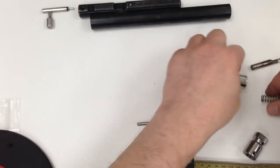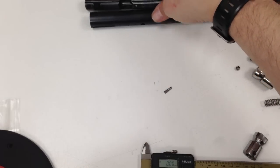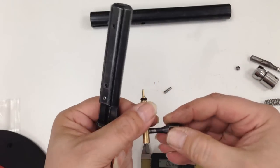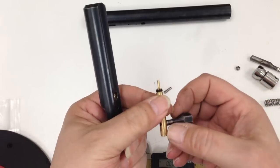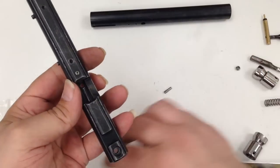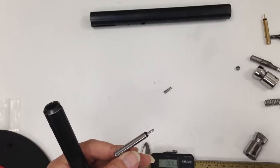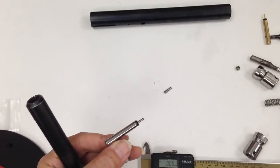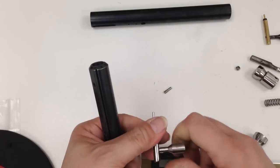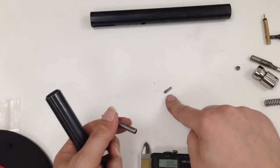Okay. Coming on to the breech. It originally came in with the brass bolt. I didn't quite like that because it kept scraping, pieces of swarf coming off, and then slightly jamming. So I've discarded this, so I've decided to make my own. This is silver steel, tempered, same hardness as the stem valve. That's the same material, silver steel, hardened. So it's less prone to scratching, and it will last longer when the pin from the hammer hits the back.